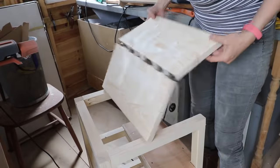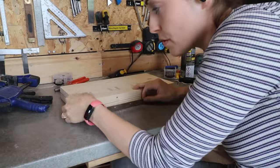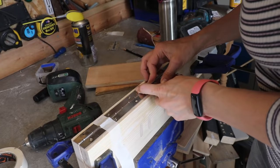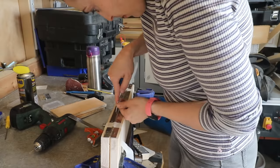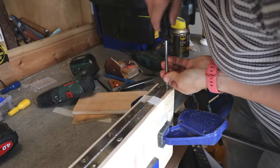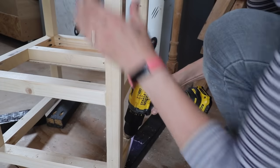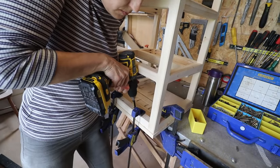I needed it to go the other way — good job I didn't put all the screws in. I had them the wrong way round — the chamfered edges should be kissing each other. I also had to make sure the hinge was dead centre all the way across, otherwise my seat wouldn't be level. I'd mark and pierce my screw holes with a brad awl, drill with a 2mm drill bit, and it's quite likely that even on the lowest torque the screwdriver will be too fierce for it. So I'd spray a little bit of WD-40 silicone in the holes or on the screw — that makes it easier to hand screw them. I didn't want screws visible from the top, so I flipped it upside down to drill and screw from underneath. Make sure that when you flip it open, those plugged pocket holes are the ones you see — that's obviously if it's important to you.